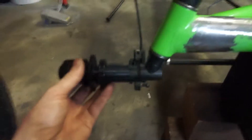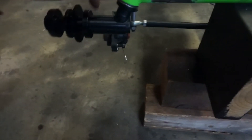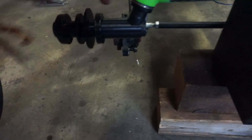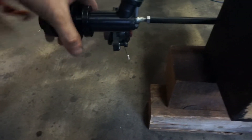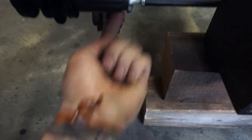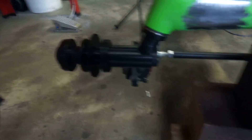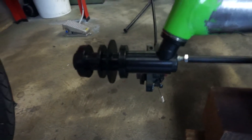We just got these axles back from the anodizing shop — that took a couple of weeks longer than expected — but the end result, as you can see, this will slide on like so. Right now this tube is just a press fit over the axle itself, so we're going to need to drill and pin that so all the torque is transmitted to this sleeve tube. Then we'll drill and tap probably three or four bolts to anchor that sleeve to the trike frame. But even if those were to fail, it's positively locked against spinning just by the cutout shape here. Pretty excited to build up these motors so we can actually try electrifying the trike.